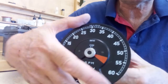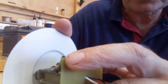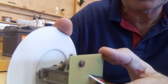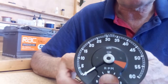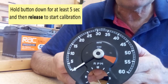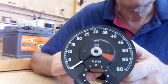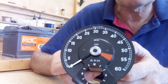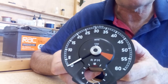We carry out the calibration using this calibration button on one corner of the circuit board. It's quite small but gives an audible click so you can hear when you've pressed it. To start the calibration, hold that button down for five seconds. When you release the button, the needle will start to move very slowly around the scale — and there it goes.